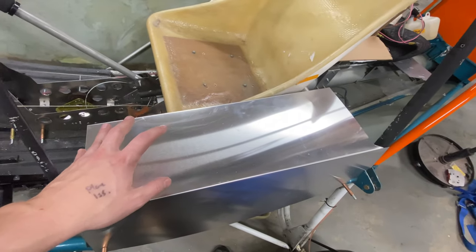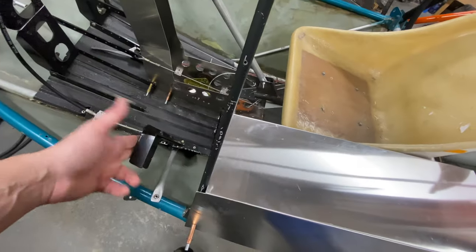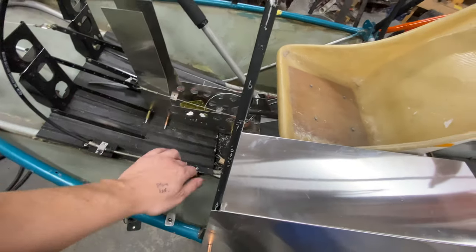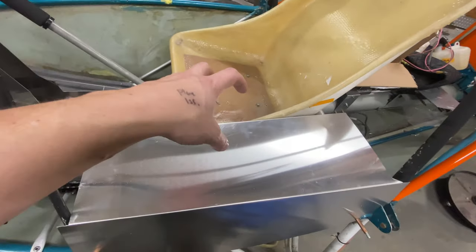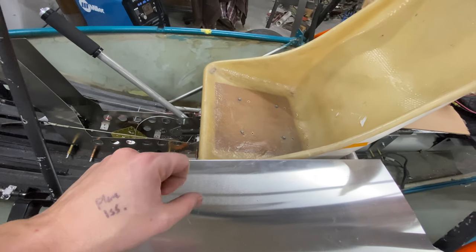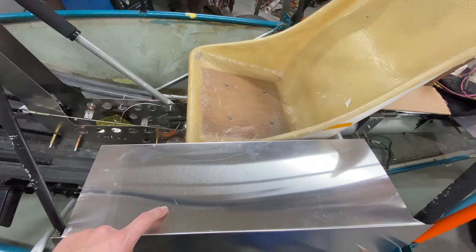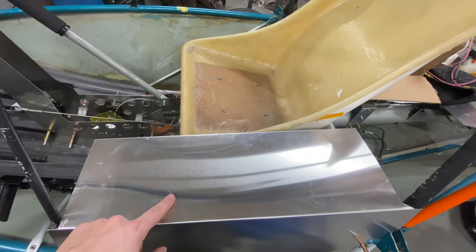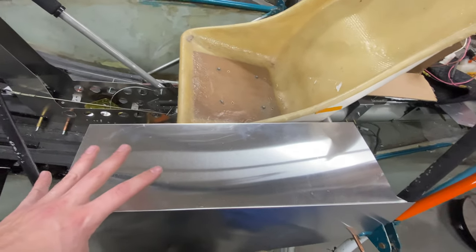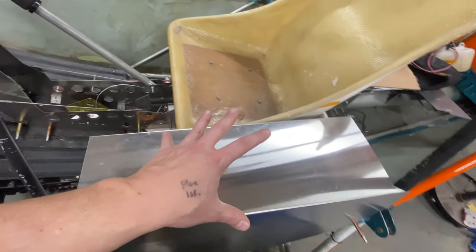I don't know if I've mentioned it before. This panel is where our throttle and flap handles will be going. Currently, the flap's up here, but it's kind of inaccessible at the moment. I didn't like that originally, so we're going to be moving the flap handle over into this console. So I think we've got two items to attack. The console needs to get things, and we may also work on the throttle and flap mounting, because they are going to figure into placement of switch panels and everything else. So that's got to happen at some point.